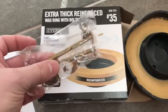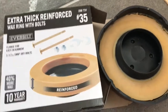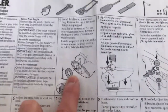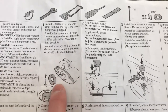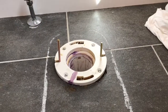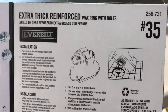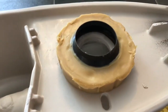It comes with new t-bolts, which I think is good — I wouldn't want you to use the old ones. We're going to lay the wax ring around the bottom ring of the toilet. Some people just set it right on the drain, but using a new toilet here they want us to put the t-bolts on first, then press the wax ring against the hole in the bottom of the toilet, then line it up over the t-bolts. So we'll put the wax ring with the reinforcement around the opening on the bottom of the bowl — consistent with the instructions for both the wax ring and the toilet — and press it in just enough that it's going to stick.